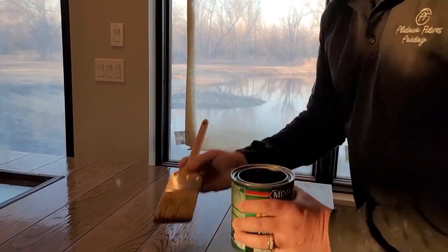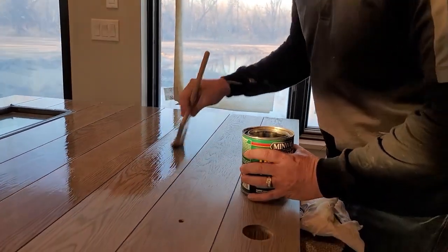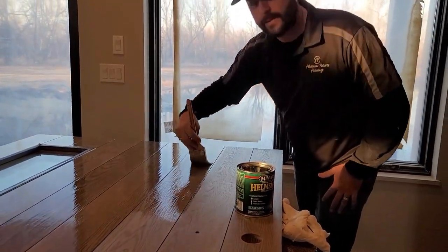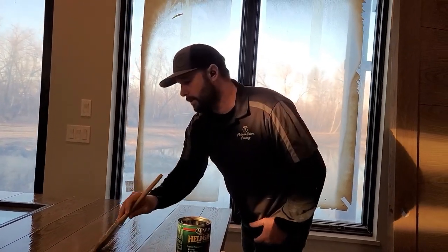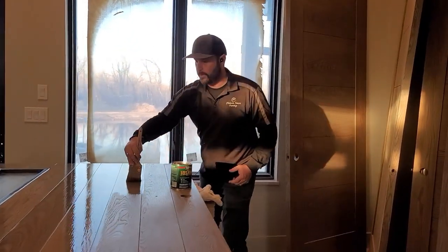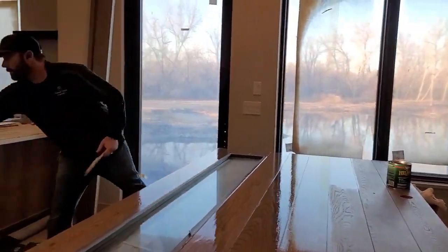What we're going to do is we're going to brush it on, and we're going to brush all in the same direction. We're going to push it in. It's actually really good for the door to get brushed, because you're kind of pushing this in all of the pores of the wood, and you're forcing the clear coat where sometimes you just can't get with a sprayer. You're really pushing it in here. So we're brushing it out there, and I'm going to show you all what I'm using.